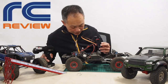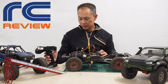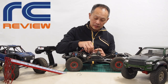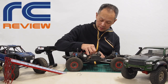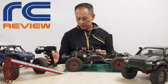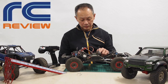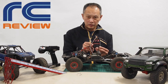To program it, you turn it off and then plug this wire in. The white wire should be facing closest to the outside edge of the ESC. Like that, and then you turn it on. I have my Flysky $37 transmitter — turn it on here, and you know your polarity is good when you see the numbers.